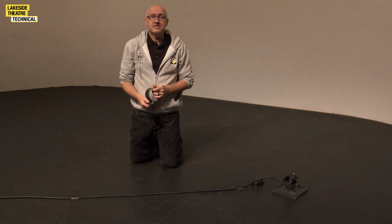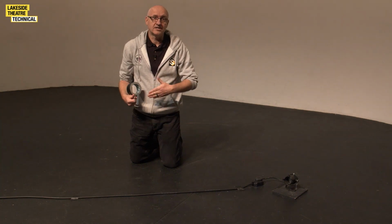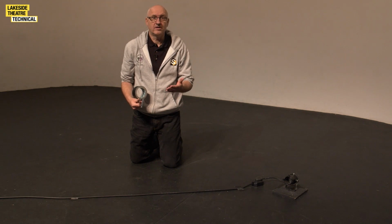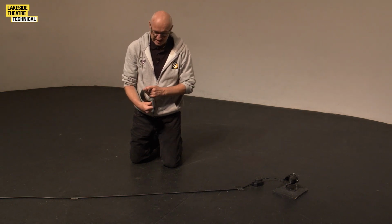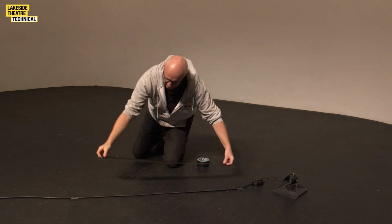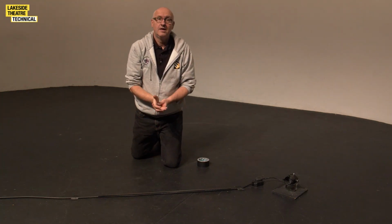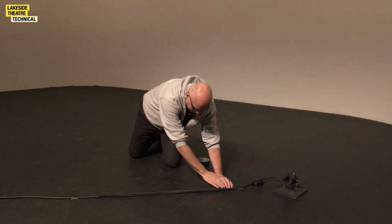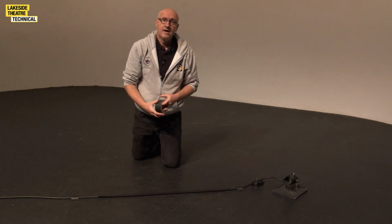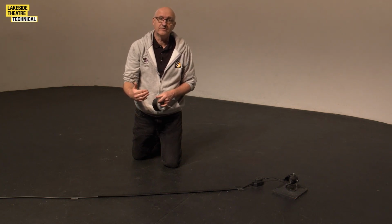And then I'm going to take about 1 metre off the tape reel now to go between the two tags, and then I'm going to lay that down on my side of the cable with a little bit going over the top of it, about 2/3 on the floor and 1/3 on the cable. That's the first step, so I'll do that now. And press that down nice and tight. And then I'm going to take about the same amount and put it on the other side of the cable with a small amount over the top of it like this.